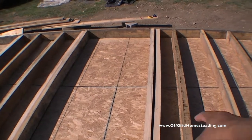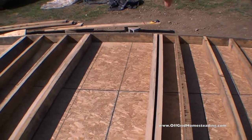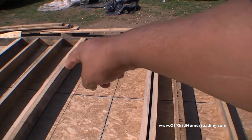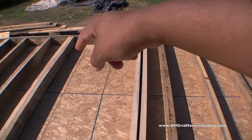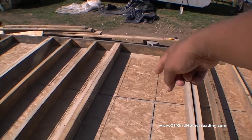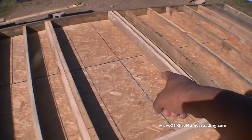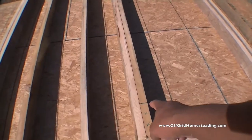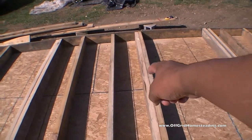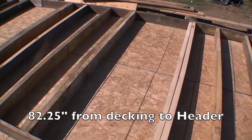And then there'll be another one going across the bottom. There'll be another beam that comes in here, a third beam there and there for the bottom plate, and then you have the framing that comes 16 inches on center in the middle there. So, pretty big window. Window's gonna come up from this point to I think 73 inches, so they're just huge.